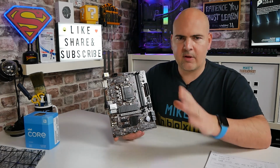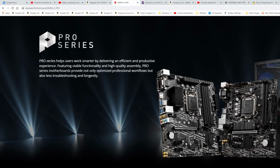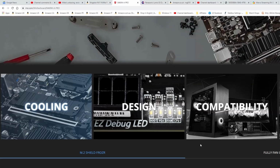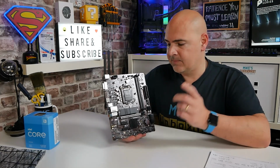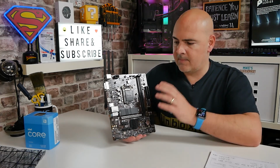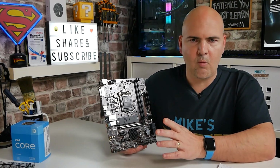Now, I should actually say, for those of you that are possibly looking at this video and maybe you've searched for the MSI B460M Pro, this is the B460M-A Pro. Both of them are actually kind of listed together on MSI's website. There are a few small differences between the two. In fact, the -A is kind of like the cut down version of it. So the standard Pro version has 4 RAM slots rather than the 2, as you see on here. It also has a beefier heatsink setup across all of the VRM, and it does support things like wireless, Wi-Fi, etc, and I believe it's got Bluetooth as well. I'm not entirely sure on that, but it's definitely got Wi-Fi.